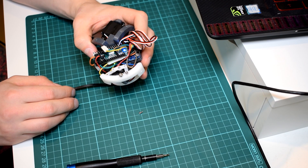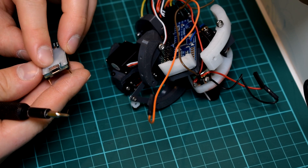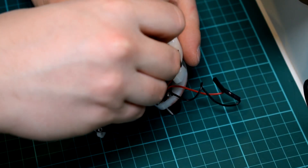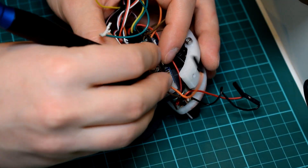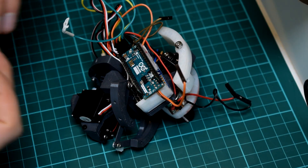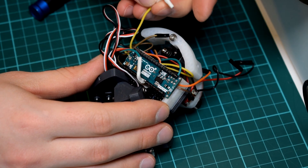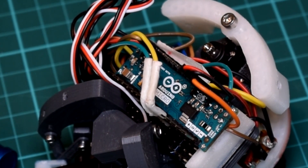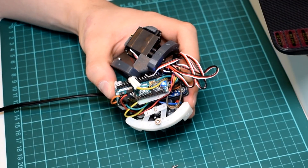The last step is to wire the microcontroller. There's a little insulating plate that you can attach to the Arduino Micro using some tiny M1 screws, or alternatively just use some electrical tape. Then use some more M1 screws to attach the Micro to the standoff component on top of the servo driver board. Look again at the circuit diagram to make sure everything is wired up correctly — remember that in this design the Arduino Micro is upside down. If you're using jumper wires for the Arduino, you'll need to remove the black connectors for the SDA and SCL wires so they can bend down and be out of the way of the moving parts. Put some tape or shrink-fit tubing over the bare connectors, then tuck all the wires away underneath the Arduino between the Arduino itself and the servo driver board. Fingers crossed, everything should now work as intended.